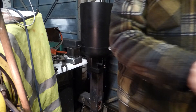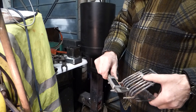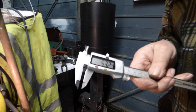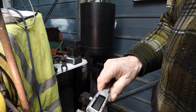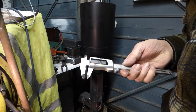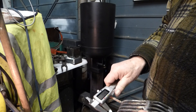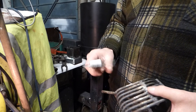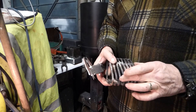That was all 6mm bar — that's 6mm stainless — and it's burnt away. So that was bang on 6mm, and it's lost nearly a millimetre in a year — that's nearly a millimetre of metal. So that shows you how much it took a year to burn that away — that's not bad. But it only burns away the ones in the middle. See these outside ones are still reading 6mm, but it's these three in the middle that burn out quicker than the others, and it is a pain to replace them.